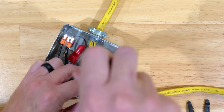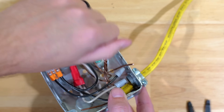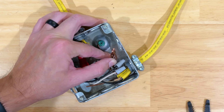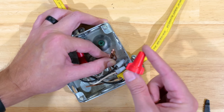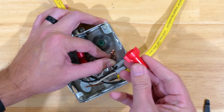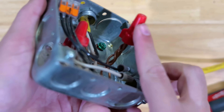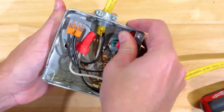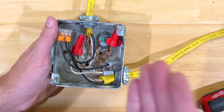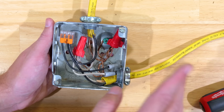Now that the ground pigtail is attached to the metal box, remove the wire nut from the existing ground wires, add the new grounding pigtail to those wires, and install a new wire nut — don't reuse the old one. You can pre-twist the wires first and then apply the wire nut, or use Wagos if you prefer. Push the connector into the back of the box, and now the box is completely grounded. If a hot lead gets loose and makes contact with the box wall, it will travel to the ground wire, back to the circuit breaker panel, and trip the breaker.